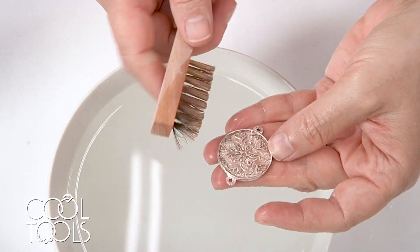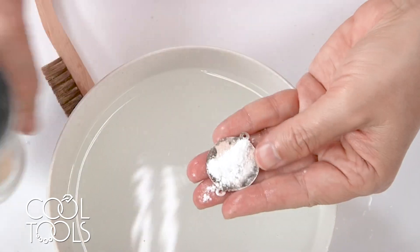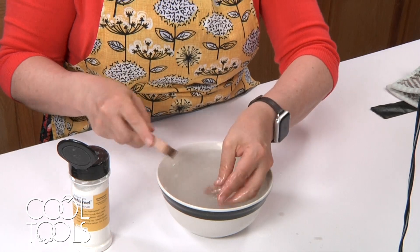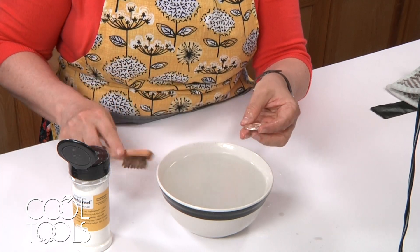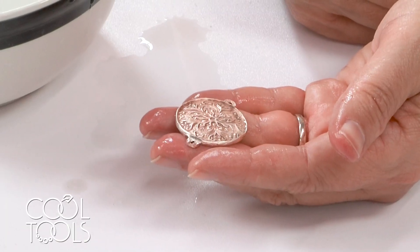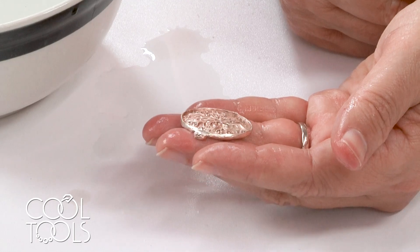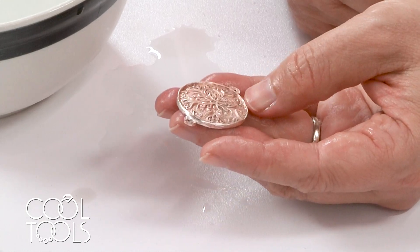I notice some bronze is transferring — I think I'd use a steel brush instead of a bronze brush, but this will be okay. If you are cleaning with a wire brush and not getting the black stuff off, you may need to redo the de-enameling — sometimes that indicates you did not get all the enamel off. Once you get all the char off, the next step is to re-fire it before you re-enamel it. Put it in the kiln and fire it just like the first time — around 1600 for 30 minutes. It should be white when it comes out; if it's not white, redo the de-enameling. Then tumble it and you can re-enamel it. I hope you've enjoyed learning how to remove unwanted enamel — check the Cool Tools website for my other enameling products.